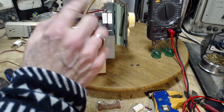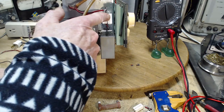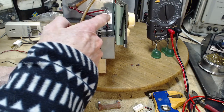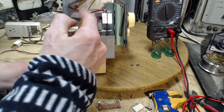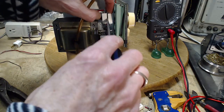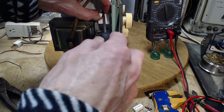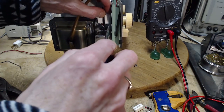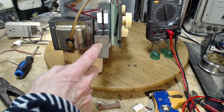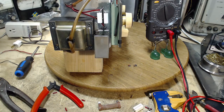That's good. Before, when I was wiggling these, and you may not have been able to hear it, I could feel the click, click, click, click, as if something's flipping back and forth. That's what clued me into the fact that the lead hadn't soldered properly. Okay, can down, capacitors in.